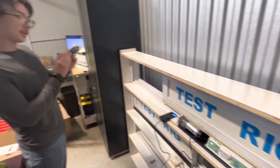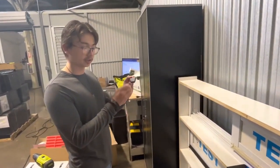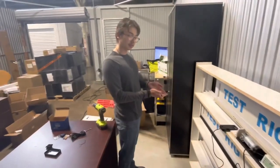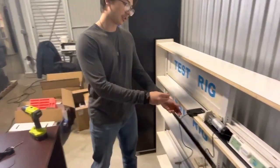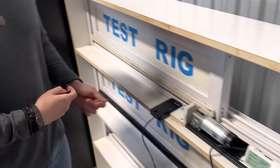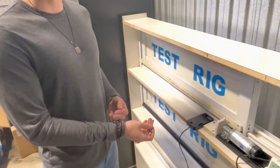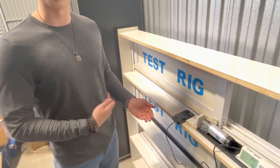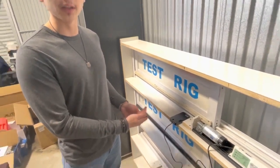Take the tag to the physical distance that you want it to trigger at — anywhere from a few inches to up to 10 feet away maximum. Then hold down the button on the tag, and once you see the tag light up solid blue, release the button. It will set itself to whatever distance the tag is from the receiver. Then repeat this process for the other tag: take your other tag up to the receiver, press the button on your receiver, press the button on your tag, and then set the distance. Continue this for as many tags as you have to pair all of your tags up to the receiver one by one.